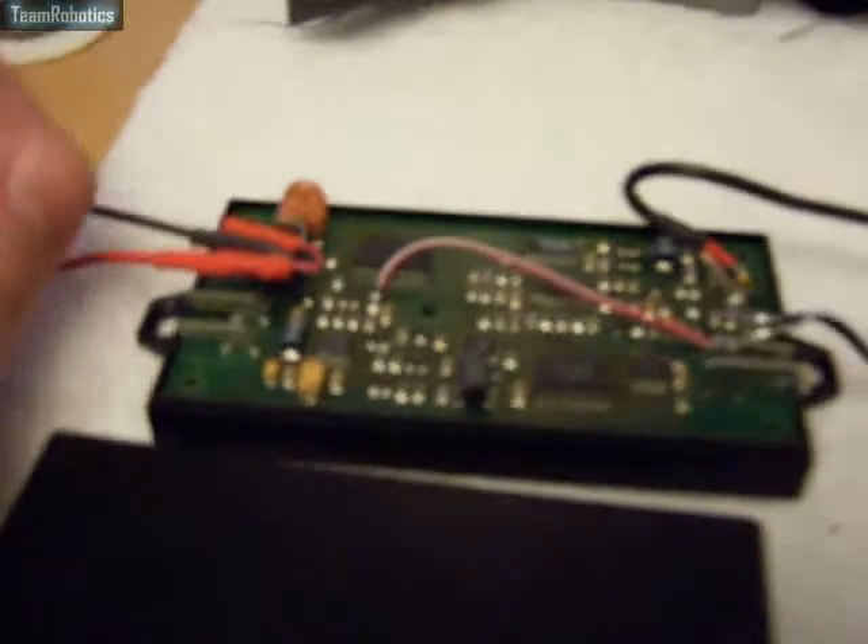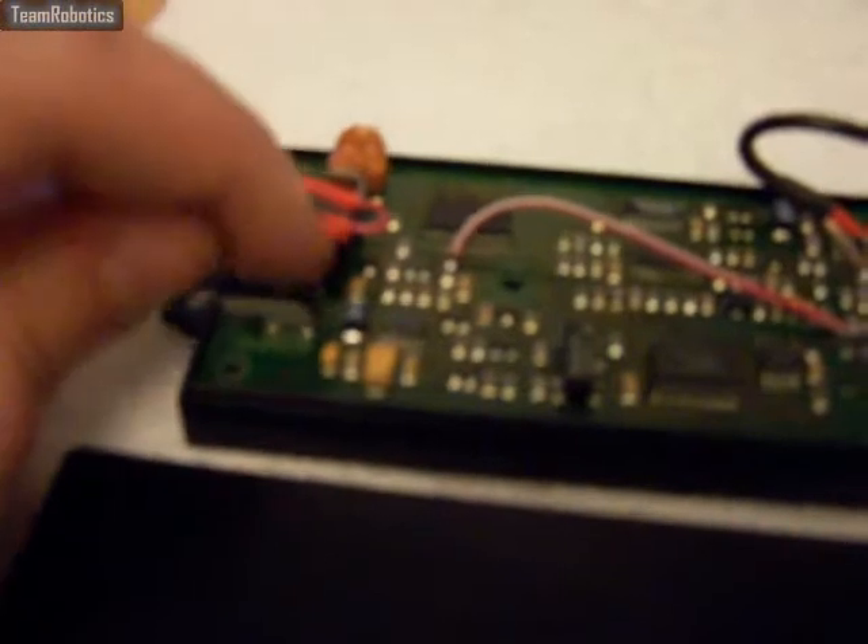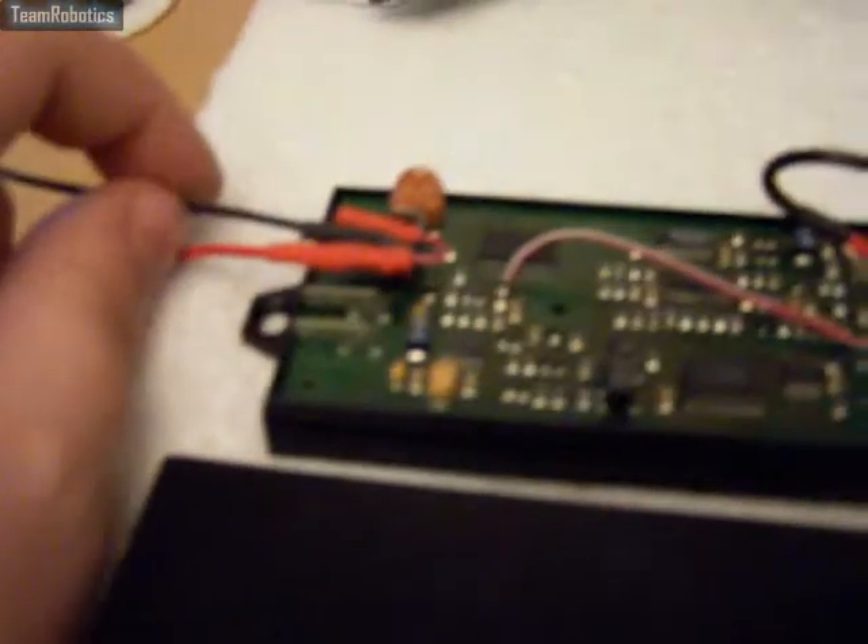Pin 3 on the top row, which is the one between the two live connections, is your ground connection. So I've done that and we've got 12V supplied — those are the two modifications.